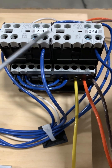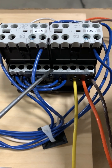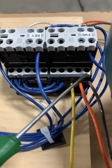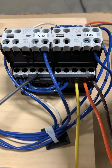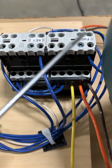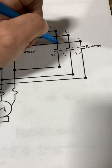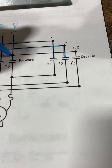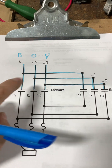Looking from the back, the forward and reverse contactors come with jumper bridges that bridge power from L1, L2, and L3 on the forward contactor over to the reverse contactor. So we don't need to run separate wiring over to the reverse side — it bridges over from the forward contactor, providing L1, L2, and L3 on the reverse contactor as well.